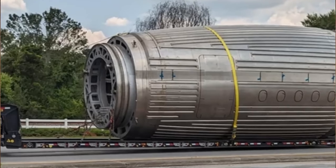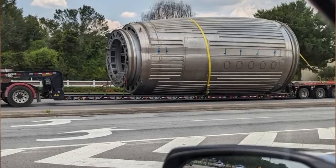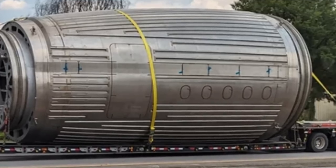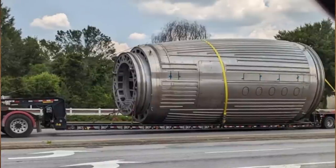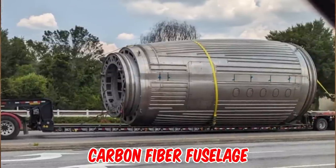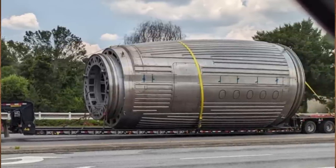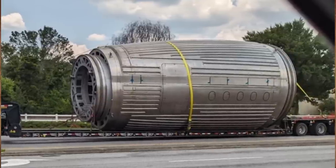What is this large metal tube with a narrowed front end, transported with a police escort on an extended flatbed trailer? The object is very large, made of metal, and has what looks to be cutouts for windows and a door. That's a spindle that Boeing weaves the carbon fiber fuselage for the Dreamliner on. The composite fuselage is 20% lighter and 40% stronger than an aluminum alloy fuselage. The mandrel is made of an alloy called Invar, or invariable.